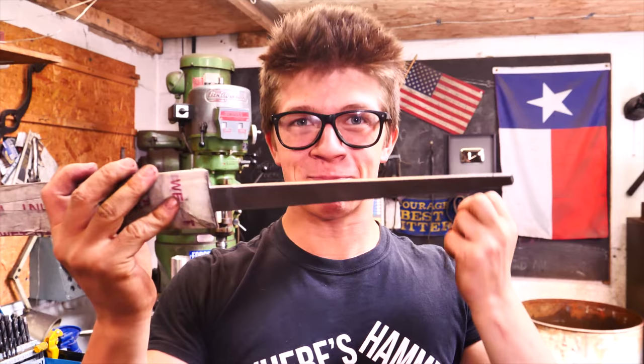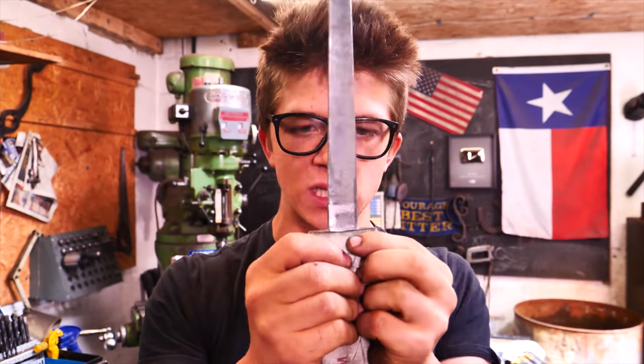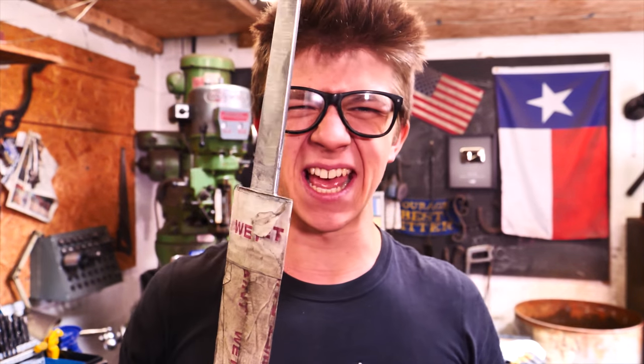The tang — it's not going back now. I've done it, it's faced off, I can't go back. That's just great because it's perfect — exactly what I was wanting to do. I put little bits of wood underneath the file guide so it was solid, didn't move. I ground it, took off all the material, brought it down to the right thinness. It's flat, even, square, perfect. I've taken so much time on this and I am just thrilled.